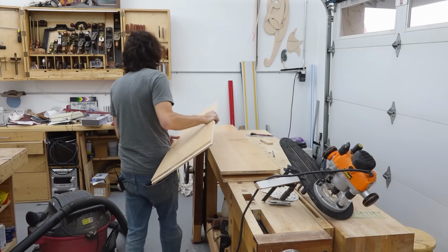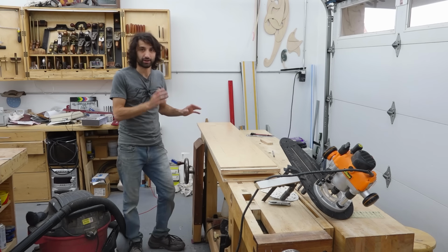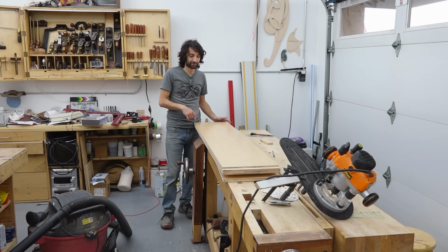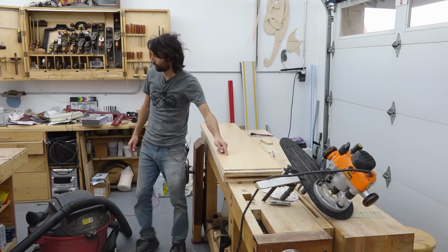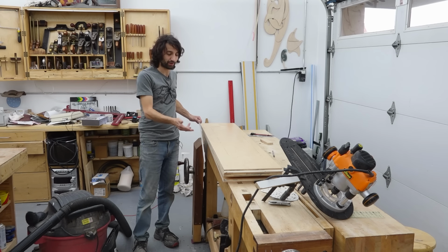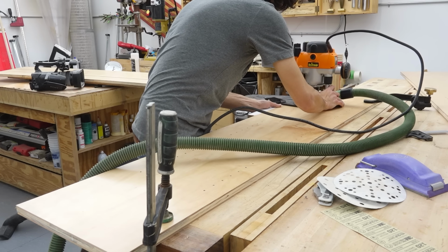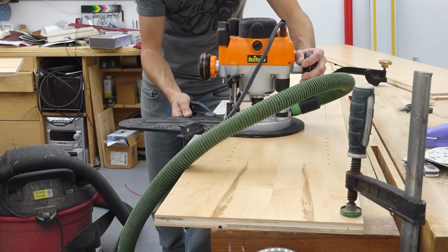Okay, while that one is off getting painted, I'm going to jump into the Hutch cabinet for the pantry. So this is all the carcass box material that we cut on Donovan's CNC, and it needs the groove in here for the bus bar that's going to power the under shelf lighting. And then once I get that groove taken care of, I'll start running through and getting some face frame stock made up for this guy.